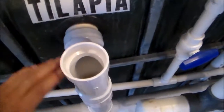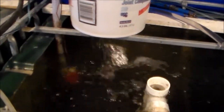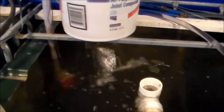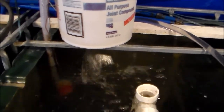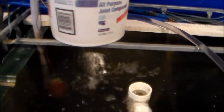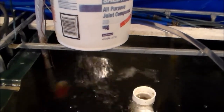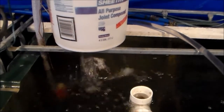You can see that cyclone action at the top — this will definitely put more oxygen into the water than a bubbler will do. When I first tried this I didn't have the water pressure right, and with too much pressure it was overflowing the tank. With this vent it will allow me to siphon all the water off at whatever rate it's coming in. This tank is now ready to have fish put in it. If I lose power, that 12-volt submersible pump will continue the cyclone action uninterruptedly — as soon as power is lost, the relay switches instantly to a 12-volt battery, giving uninterrupted flow. No more chance of a fish kill from a power outage like I had in the past.